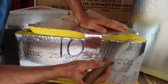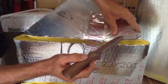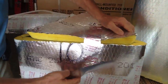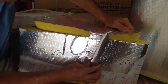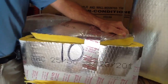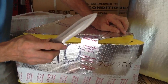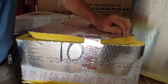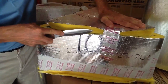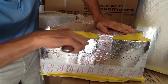The reason being, you still have exposed ductwork here. This is your vapor barrier — one thing you got to remember. As the heat chases cold, you've got that heat trying to dive into your cold air. With this being the vapor barrier and it being totally insulated, it helps the airflow — the 57-degree air going into your conditioned space. When you have this exposed part in the attic, you have heat penetration going in.